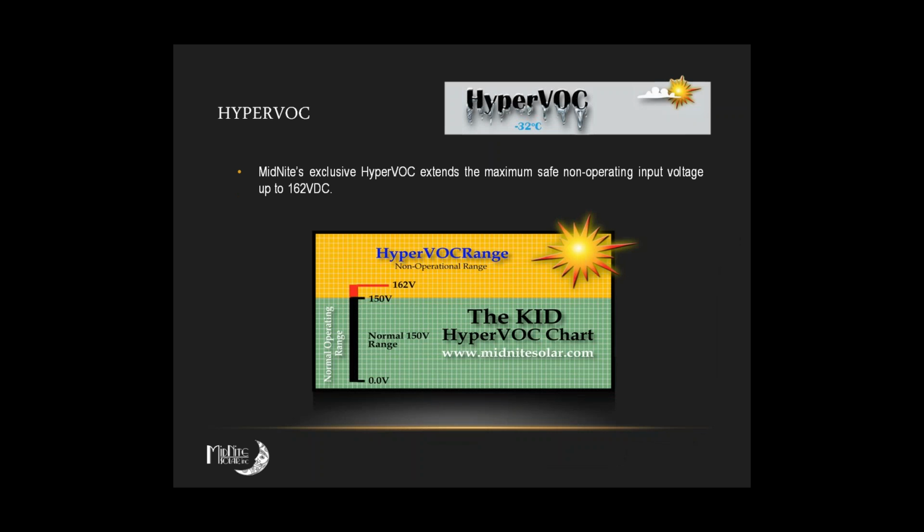Yeah, we talked about this here. You just don't ever want to get up over 150 volts if you can help it. And if you're doing series parallel on the 4 panels, or you're doing series on the 3, you're perfectly fine. Pretty much general rule of thumb on most of the modules that have under a 40 volt open circuit voltage, you should be fine with no more than a string of 3 on the KID. And again, use the string sizer to double check yourself.